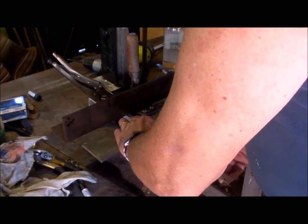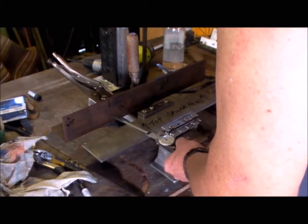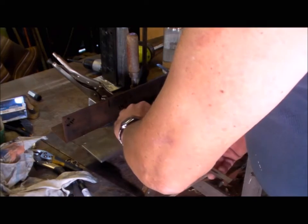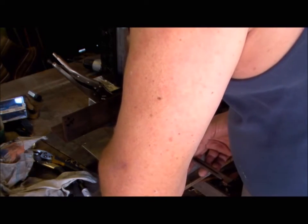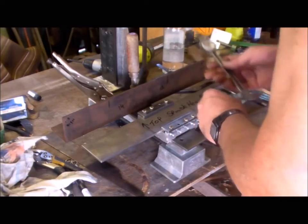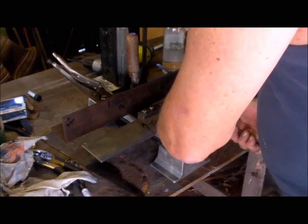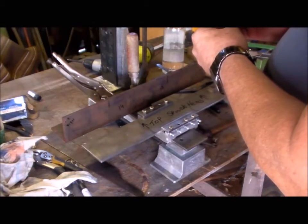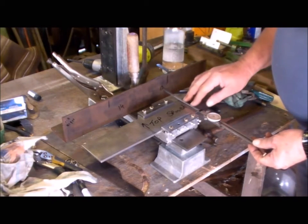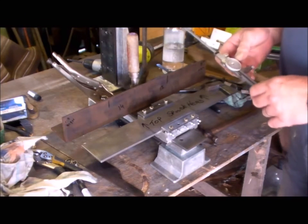I think everything's square — that's the problem. I'll lock that. I can never remember which one to push — it's that one. What have we got: 48? Okay, 5.348. And it's 55. Didn't have that measurement before. But 46 — 2-thou difference.